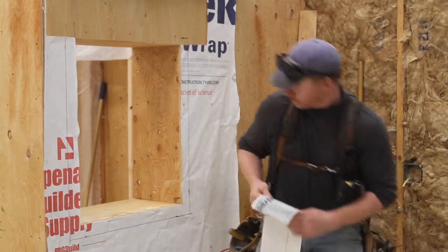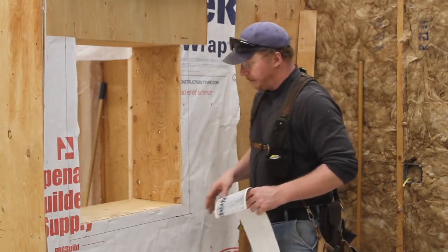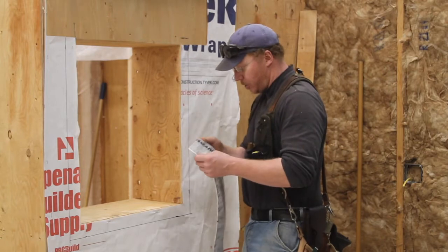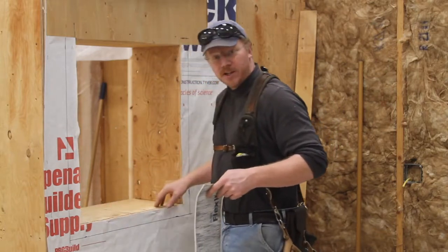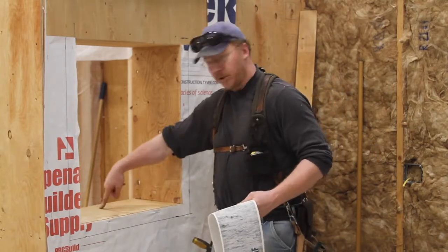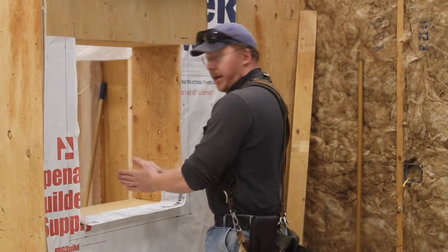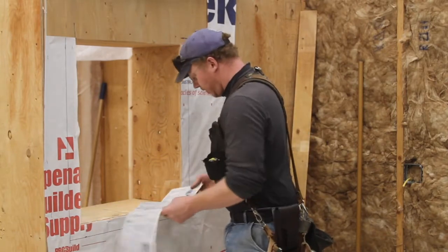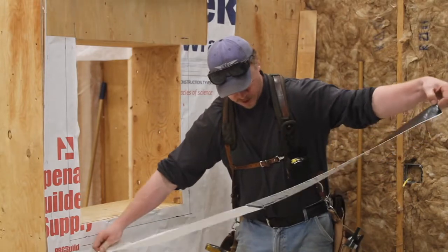For step one, I've drawn a line here at two inches for the side flashing and two inches for where the sill flashing should stop. It doesn't have to be a line — it's just so whoever is installing it knows where they need to keep their flashing on the outside edge. The 9-inch flex wrap is likely going to be a split release liner that will make your install potentially easier than mine. On big windows, I like to mark a center line on the tape and have a visual center line on the plywood in the sill, so when I'm setting it I can just set it right on the center line and work my way either way.